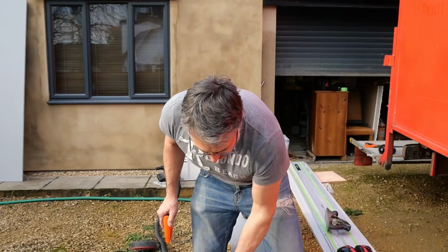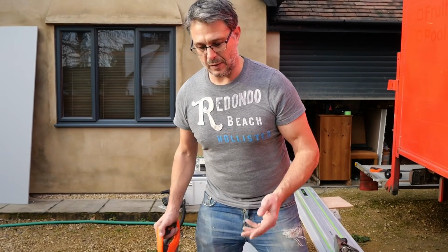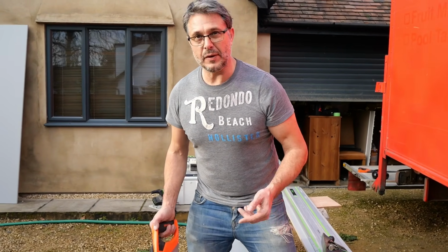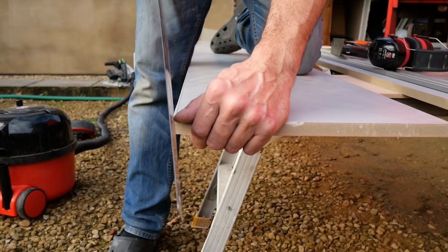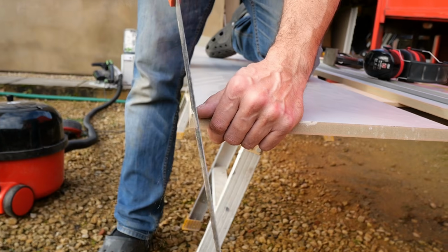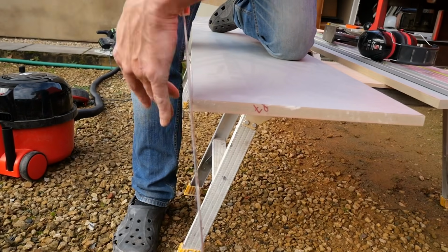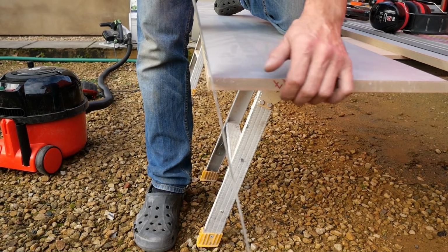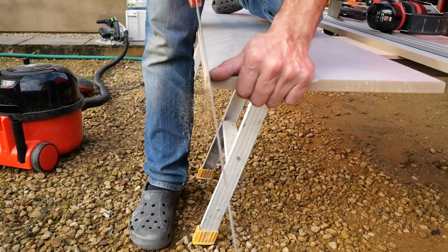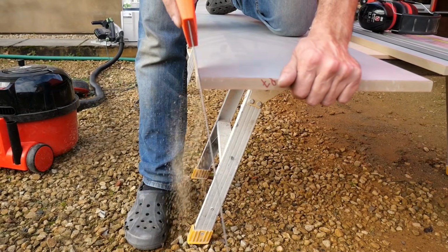Anyone will tell you, you might already know, trying to cut a very small amount off of the board down to nothing can be dangerous. It's your hands, sharp saw, and also be really fiddly. So what I tend to do is just take my saw on a very slight angle, and that way I've got a nice bit of meat down the bottom, so even when I come to next to nothing, I'm still sawing away at the back bottom, in this case the wood. It'll just hold my saw nice and steady. Just leaving the line in.